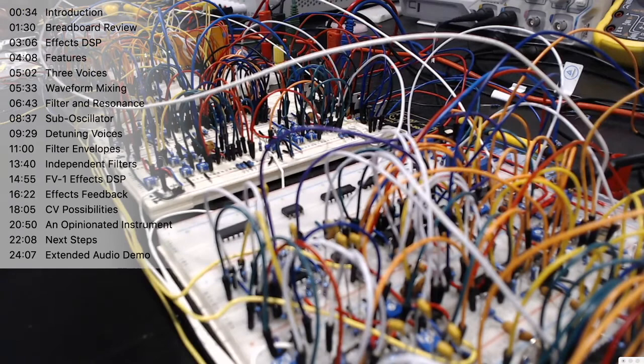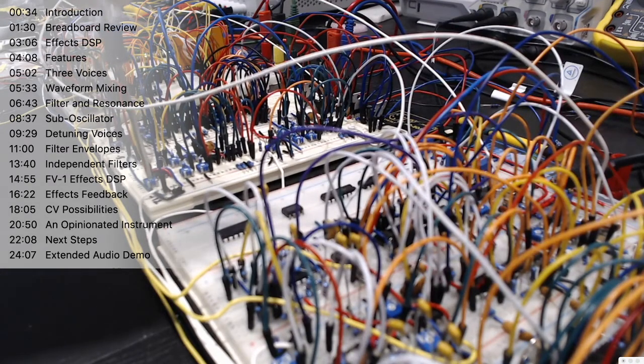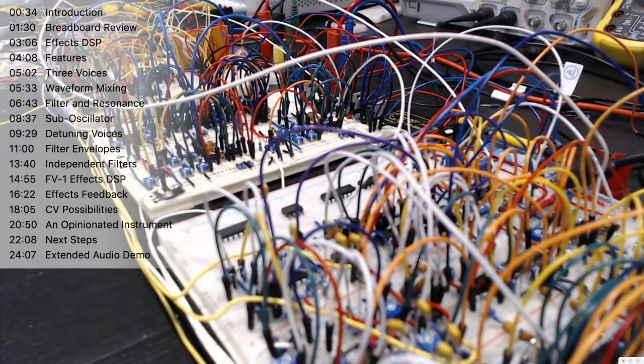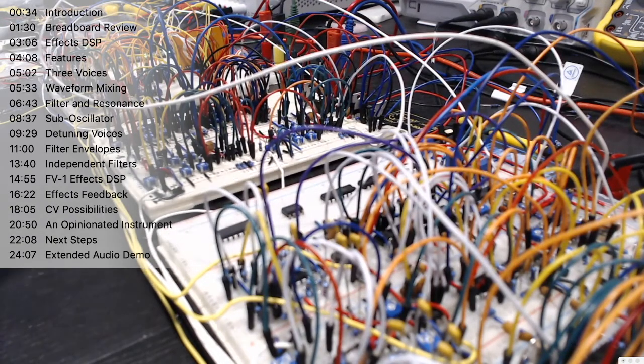We'll simplify things here. We're going to turn the reverb right down so I'll play some notes and you can hear the changes. So we're down to a totally dry signal. I'm going to dial back the envelope generators so that they're not coloring the note. I'm also going to turn it up a little bit on the mixer, because it tends to get a little bit quiet once you've turned all those things off. And just make sure we turn all these envelope generators off. There we go, all four of them.